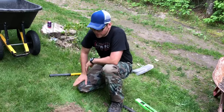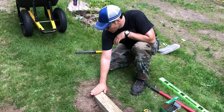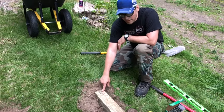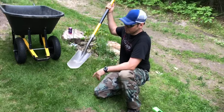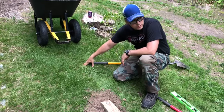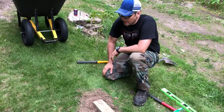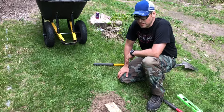The next step is gonna go right here and the first thing I need to do is dig a small trench for the back part of the stair to go. It's gonna be level with this surface here — I'm gonna dig it back with this little trenching shovel, it's just a little wider than a 4x4. Then I'll get it a little bit beyond level and use some gravel to fill it up and do the fine tuning so I can lay that in place.